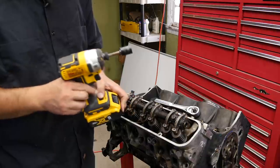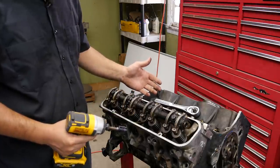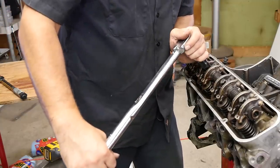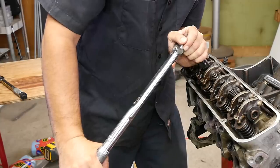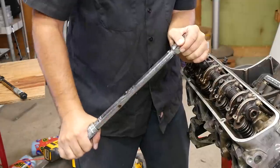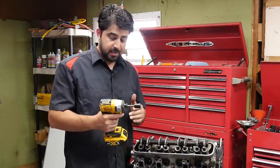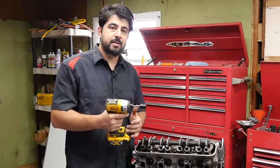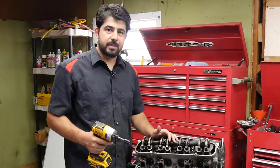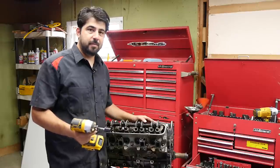Let's put it in the third setting and try this again. Do not worry about this bolt — this camshaft, cylinder head, and engine are for demonstration purposes only. At the 40 foot-pounds setting on the torque wrench, it moves — which shouldn't come as a complete surprise because according to manufacturer specs, the second setting had 125 foot-pounds of torque and the third setting was 152 foot-pounds of torque — another huge jump. Of course there are variables and limitations; on a bolt size like this we were able to tighten it to about 37 foot-pounds of torque.